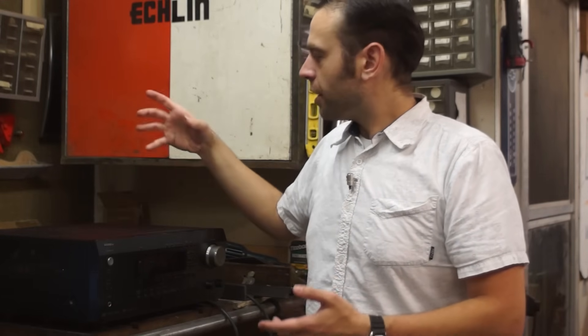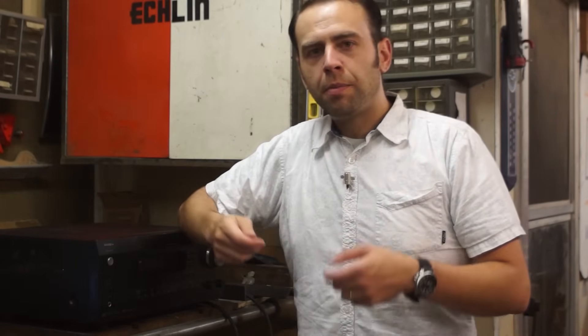So it's very common to go in, pull out the HDMI board, desolder all the 100 microfarad capacitors, put brand new ones in — potentially upgrading them to a higher rating from 85 to 105 degrees centigrade — put it all back together and hope that when the capacitors went out it didn't fry anything else.